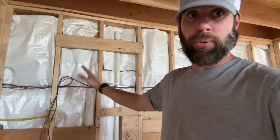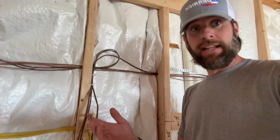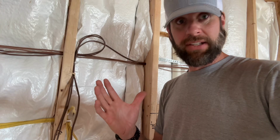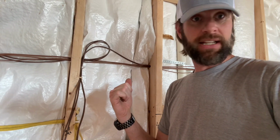With that being said, all appliances such as boilers, hot water heaters, stoves, ovens, washing machines, microwaves, refrigerators, freezers, everything like that, they need a dedicated home run by code. So think about big appliances. So what I did here on this particular furnace, this boiler, I like to mount a surface mount handy box that I put an SSU on, which is a disconnect switch. Another thing by code, if you're here working on this appliance, you need to have your disconnect within line of sight.